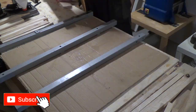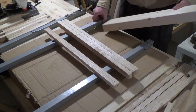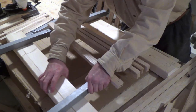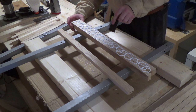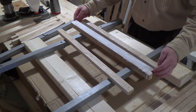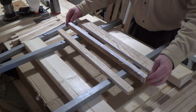I got these steel boards from an old IKEA desk — I'm going to use them to keep the boards flush when I do these laminations. I got this tip or inspiration from Matt at Badger Workshop, and as always there will be a link to his channel in the video description. You've probably seen me do glue-ups before, but I've repurposed a ketchup bottle to keep the glue in. That way I can just keep topping it up and squeeze it out like normally, then smear the glue out with a little piece of cardboard.